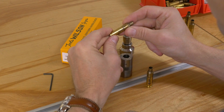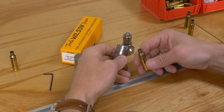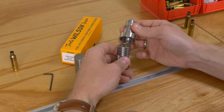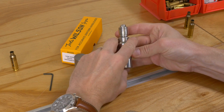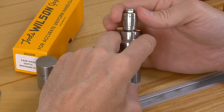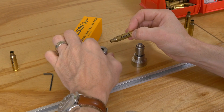I recorded 0.009 inches as my measurement of that piece of brass — that's way too much. Even for an auto loader we'd want to be at half that. So you progressively back your die out if you're pushing back the shoulder too much. With another measurement here, clamping it down hard, it hits right at five — so now we've got about two thousandths of an inch of setback. We could fine-tune that if we wanted to, but two is fine.